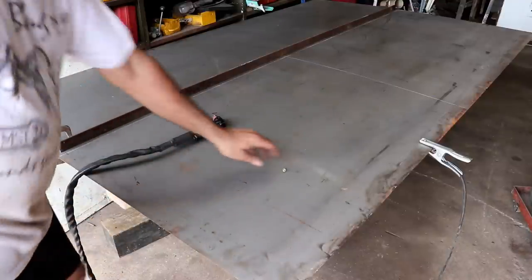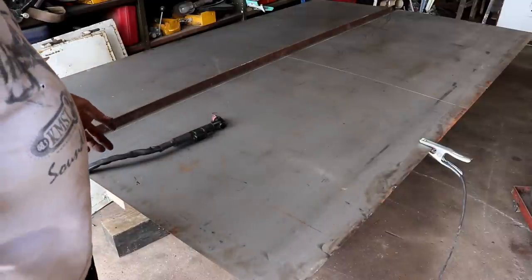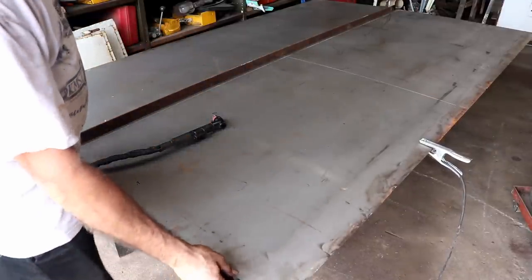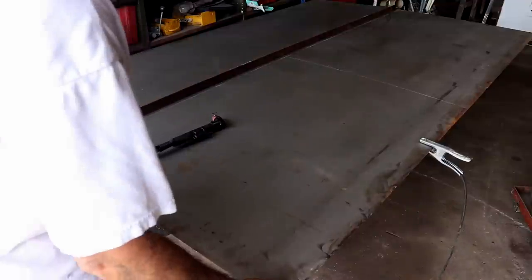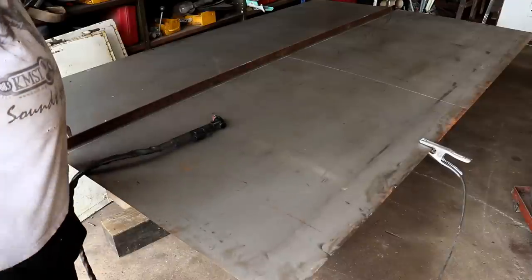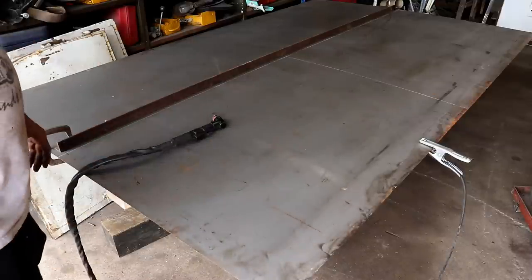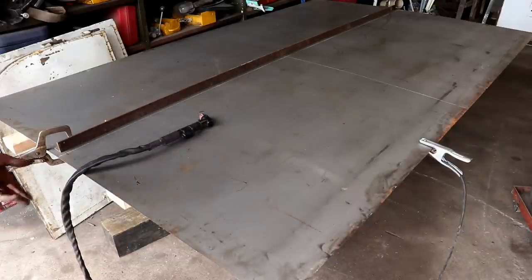As you can see, we have a large piece of sheet steel here. It just so happens — very fortunate — that our neighbor is a scrap dealer and he deals in all kinds of scrap metal. He had two big sheets of this stuff laying around, just about exactly the right thickness; it's actually maybe even a hair thicker than what the trailer's made out of, just a few thousandths thicker. That's a good thing — it's actually sturdier than what was on there originally. So I'm going to cut out the two doors now and get them ready to put in. I couldn't reuse the old steel because it was all rusted out. I'm going to use my plasma cutter — a cheapie I bought off eBay, but it seems to work pretty well. For the very first time I just replaced all the consumables up in the tip.